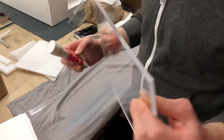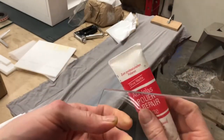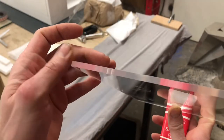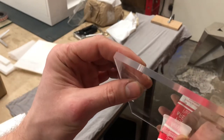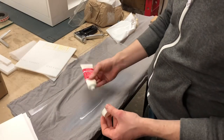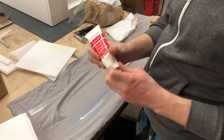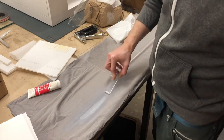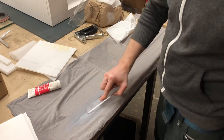So that's straight from the mill, so the surface finish is not bad — it's a cut acrylic bit — but it's not really polished. I just add a bit of this polishing paste. I think toothpaste with the small polishing micro grain things in it would work as well.